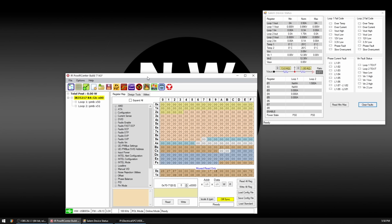The reason why I flashed it is sometimes firmware gets corrupted, though I kind of saved the firmware out. Maybe there's some kind of a reading-writing error. I don't know. I'm going to try this first. If that doesn't help, I might try to flash it with another configuration, but then that would be the last time I will be able to flash it. And if that firmware is not going to work, then this IC will have to be replaced. So we'll see.